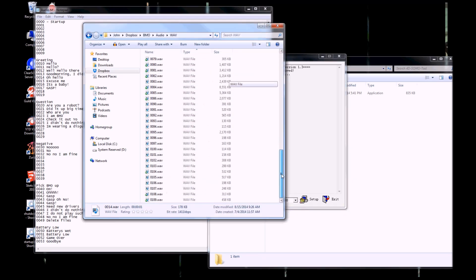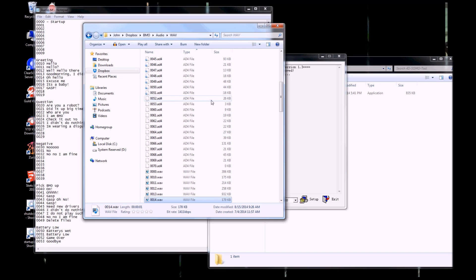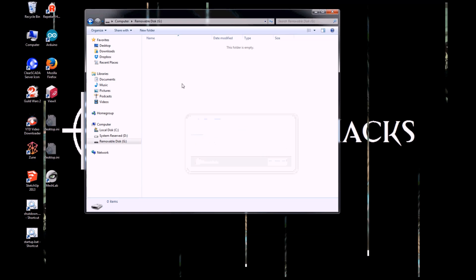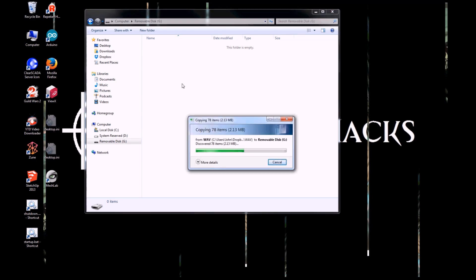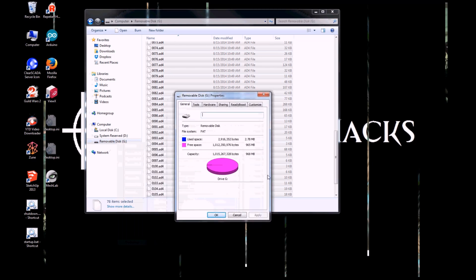Here's my SD card. This particular audio player can only play — I think you can get 512 files in here. I had a lot of trouble until I found I had a 1GB SD card that was using the FAT file system. I would suggest trying that.